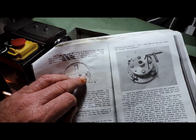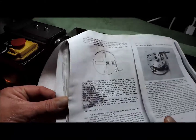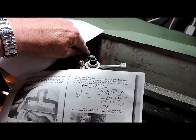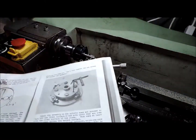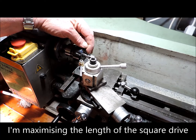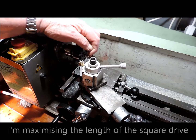When I made the screws, the flanges — these shoulders up here — I made them 2mm and they were supposed to be 1.6mm, so I'm just trimming them back to 1.5mm, which means I've got to undercut the square down to 10mm.